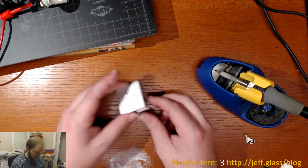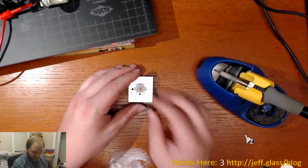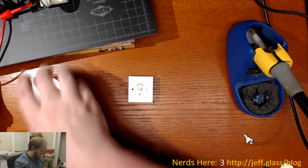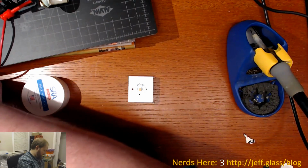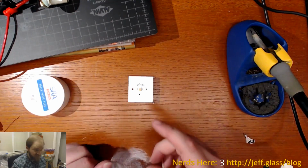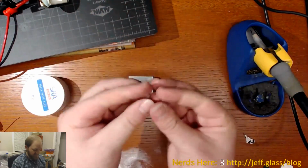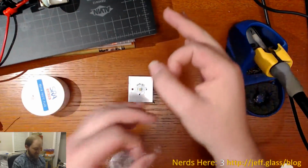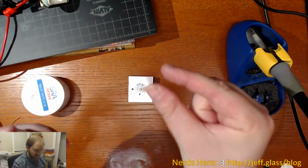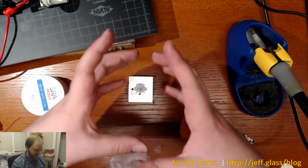At one point, I took one apart just to see what was inside of it. All of the part numbers were Chinesium, so a little bit hard to decipher. But with a bunch of Googling after the fact, they were using a very similar sort of buck converter power architecture that I had settled on, which was super encouraging. It was 4 RGBW emitters underneath a giant lens, and there were 4 of these buck converter power drivers sitting on a big fat 1/8-inch steel PCB underneath it, presumably for heat sinking the LEDs. Then there was a heat pipe coming off the bottom of that with a fan.